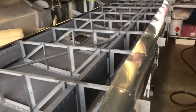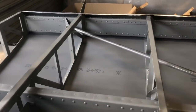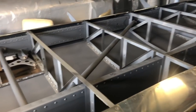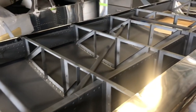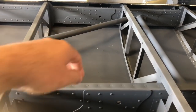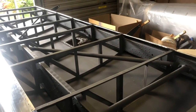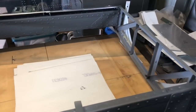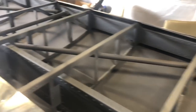For my next trick - bottom skins. Got it all mounted back up on the bench again, got the two degree washout still, got it nutted out now. Inspection hatches - working out where to put them and what I'd particularly like to keep an eye on during the first 100-hour inspections. Got the strut attached there and there, so we've got to nut out something for that. Probably try and run a conduit for electrical cables - nav lights or something like that would be handy. Still got to figure out what we're going to do with the fuel tank area. But for now we can do the skins anyway. Watch this space.